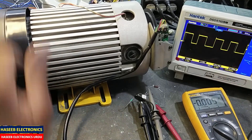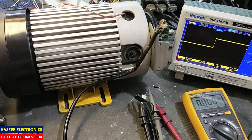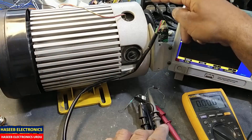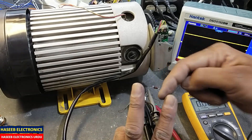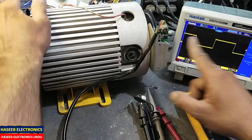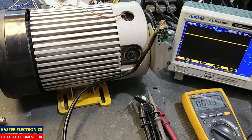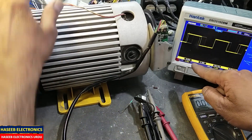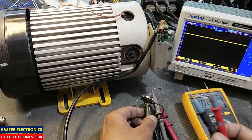Now rotate the motor — it is giving 4.6 to 4.7 volt peak-to-peak and the frequency is now 182 Hz. When we move it faster it will give more frequency. Rotate in the opposite direction — it must still give the signal, because when the cuts of the rotary disk move between the IR LED and the photo transistor, each cut generates a pulse. That pulse is sampled through the logic ICs and we get a logic voltage output — about 4.7 volt peak-to-peak.